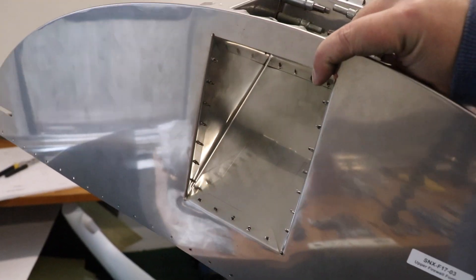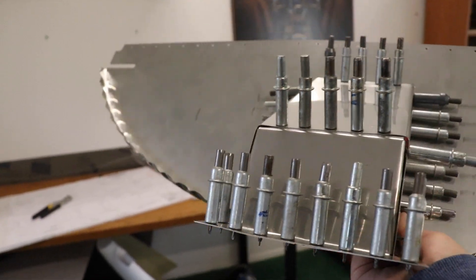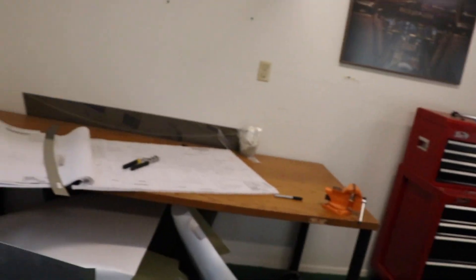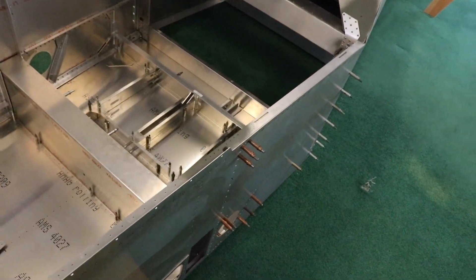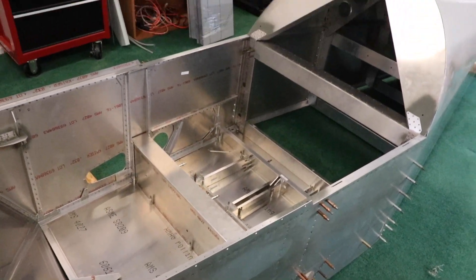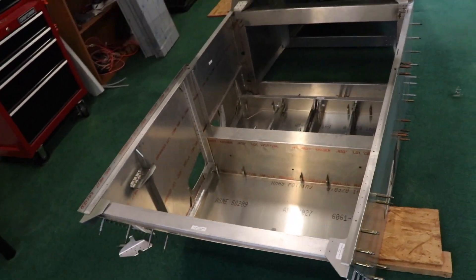The box doesn't look aesthetically pleasing, but at the same time this thing is so strong, and this is not really a part that carries any weight — it's more just the firewall keeping any possible fire from the engine compartment from reaching the passengers, which is a good thing. I think tomorrow I'm going to start working on the wing box. I really need to finish the wing box so I can get it permanently mounted to that bottom skin, and then pop it back up on the sawhorses to attach the wing box from below and hub-and-spoke out the rest of the holes to make sure it fits nice and tight.